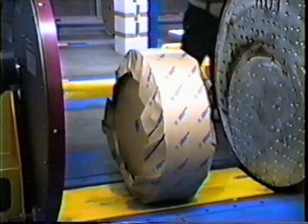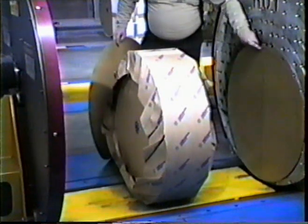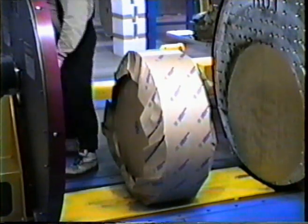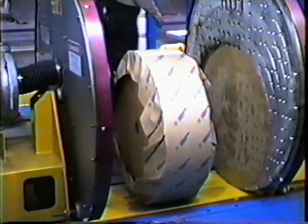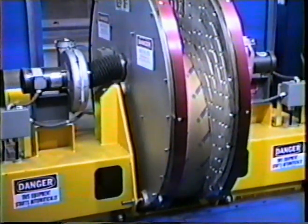Once the roll is crimped, heads must be attached. The Brinkley header consists of two electrically heated platens, which are air operated to position and hold the heads against the roll while they set. As shown here, the heads are manually placed and held in position with an integral fan on each header, which draws air through the platens. The heated platens fuse the plastic coated heads to the roll. This is done at a temperature of 350 degrees Fahrenheit. Lower temperature heated platens are used to dry glue.